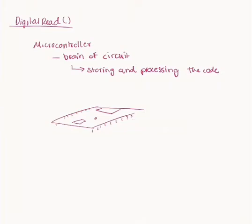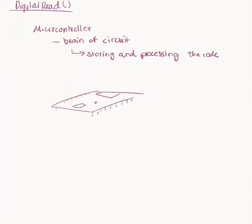If you haven't familiarized yourself with the first video on digital functions, I highly recommend doing so. It'll be linked in the description below. But for a brief overview, pin mode allows pins, these pins specifically, to be assigned as inputs or outputs based on their role in the circuit. This is where DigitalRead comes into play. For inputs, as the name implies, the microcontroller will be receiving data. So inputs equal receiving data. And this could be because it's connected to a sensor or whatnot.